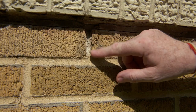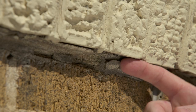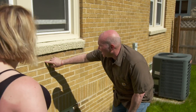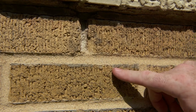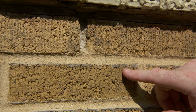Mortar's completely fallen out of this head joint — we're going to correct that. If you look at this bed joint under the sill, it's starting to crumble, too. It's very crumbled, gray, wrong color. You can see we had a guy come in here and he matched the color pretty well. The guy before him, though, not so well. You see this gray mortar? It's just a sloppy guy doing a sloppy job. We're not going to work like that, of course.